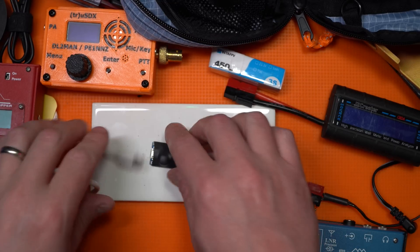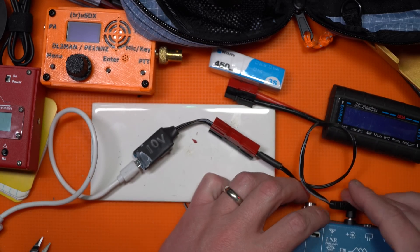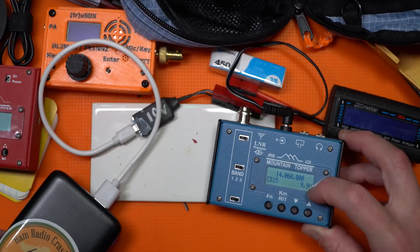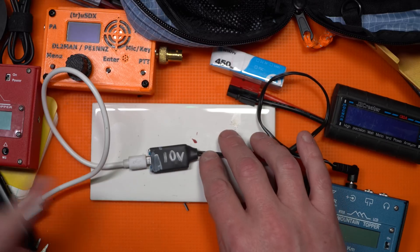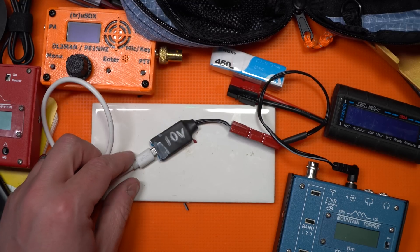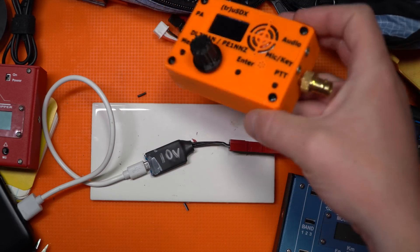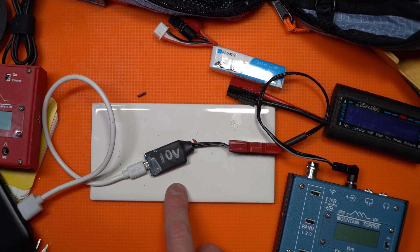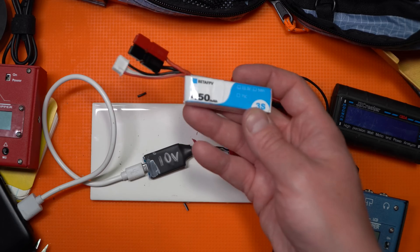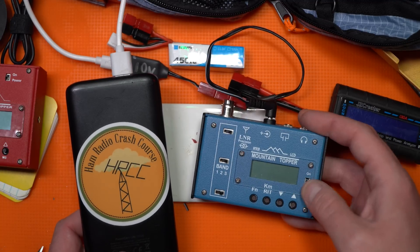Let's do a final test. We'll plug in to the radio, make sure our battery bank is on — and there we go, 9.9 volts as shown on the radio. These little up converters are incredibly cheap. You can spend less than $10 and buy basically a bushel of them. You can adjust them to your heart's content — want to make a bunch of 12 volt adapters, go nuts. For me, this 10 volt job makes it easier to step away from 3S LiPo batteries, which I have no problem with — I just don't like charging them. I always have a battery bank on me, which is why this is a really nice solution.